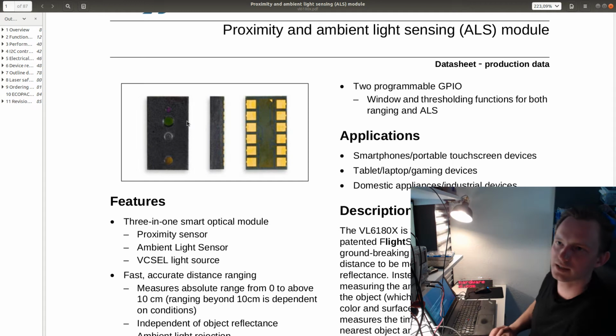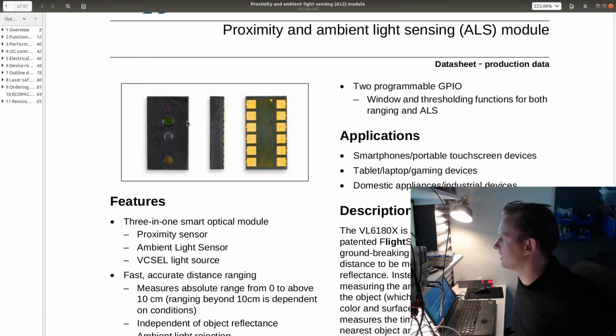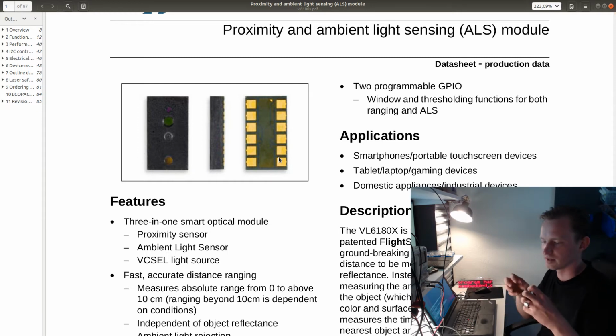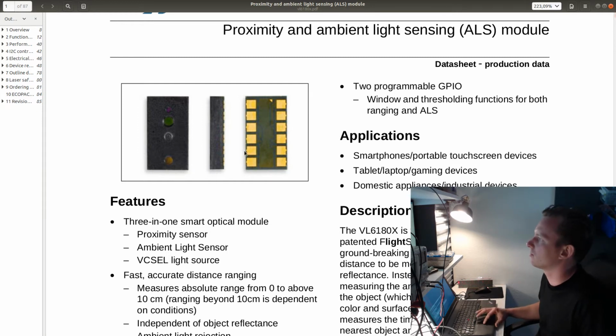Okay, this one seems to be in place. They're a bit hard to solder, because you have to make sure that there is solder on all of the pads. I tried the method where I would apply some solder paste along the pads, and then heat it up so that it would form solder balls on the pads. Soldering after that, I got very good results. So I had all of the pads connected at once. But right now I didn't do that, so we'll see if it's connected.